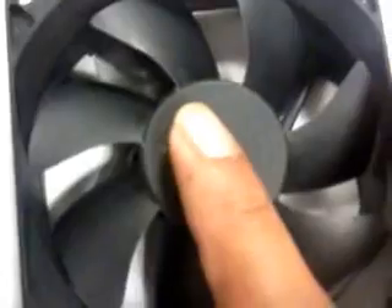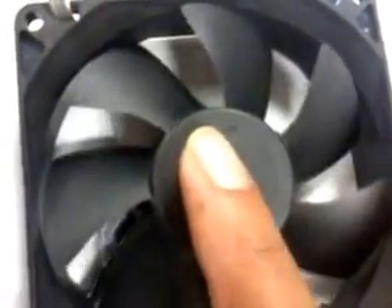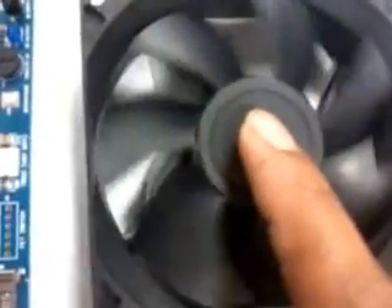This is our motor running. Now if I stop it, it should start automatically from zero speed — ideally. So far we have implemented this, and yes, it is able to start. As the motor coils are tapered, it stops in a position from where it should move in the forward direction by default.